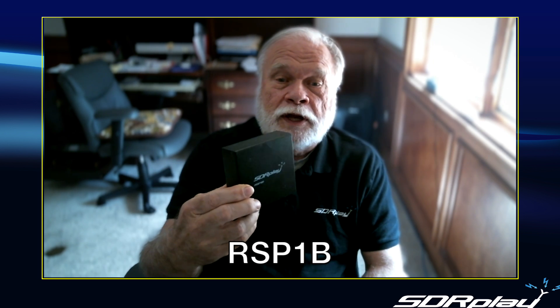Let's start with the RSP1B, introduced early in 2024. The RSP1B was built as a way of ensuring continued supply of components which were becoming hard to source for the RSP1A. Our engineers also took the opportunity to make some performance enhancements. One thing readily noticeable is that the RSP1A was available in a plastic case while the RSP1B is in a metal case. Contrary to popular belief, that was not done for better shielding — the RSP1A has very effective shielding via a spray-on conductive coating inside the plastic case. It was done mainly out of customer preference; everybody seems to prefer the metal box, and it is very rugged with a good heft to it.